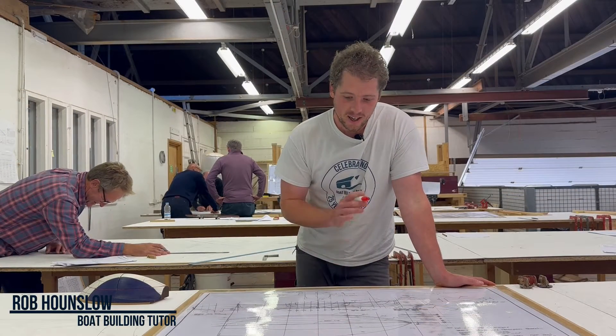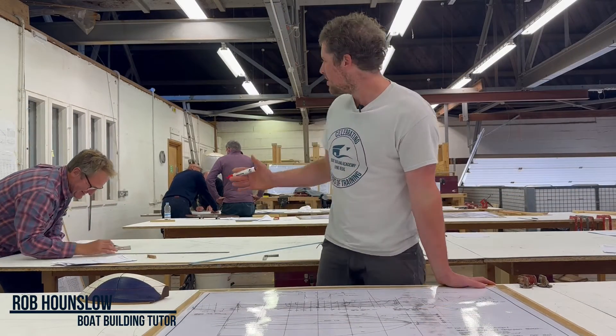In this short video I'm going to try and explain what the students behind me are doing on the 40-week boat building course, which is a process known as lofting. On the 40-week course we loft all of the boats that we build here at the Academy. Lofting means we're drawing the boats out full-size to plans, and from those full-size drawings we can get useful information about bevels we need to take at the stem, and we also get the shape of our building molds which we will eventually plank the boats around.